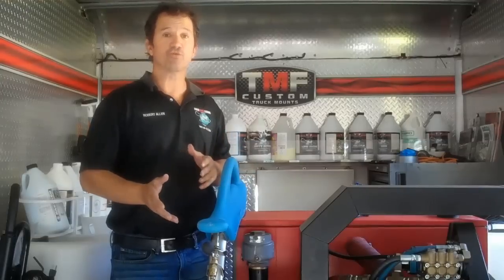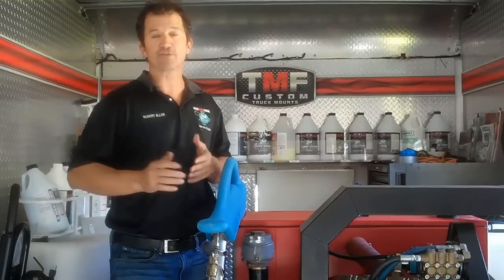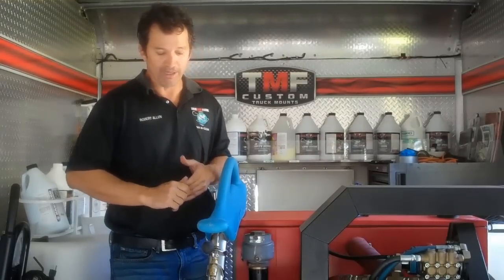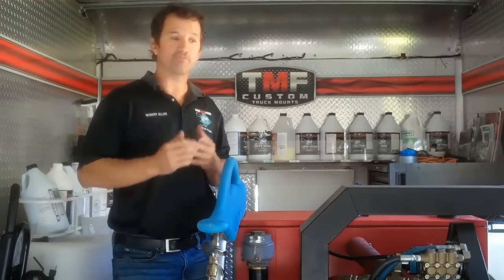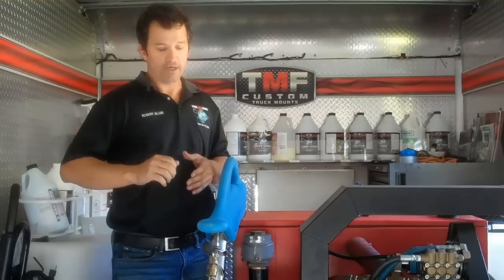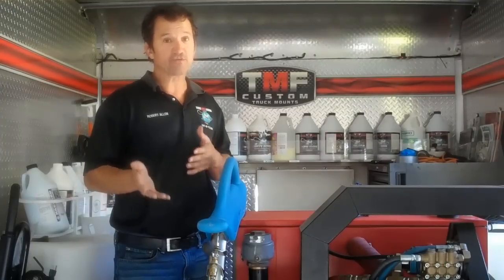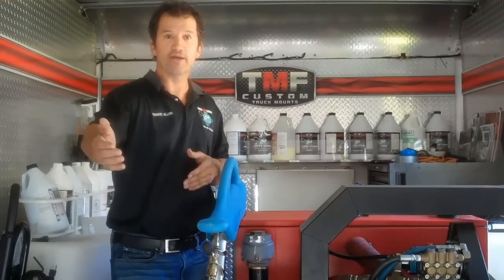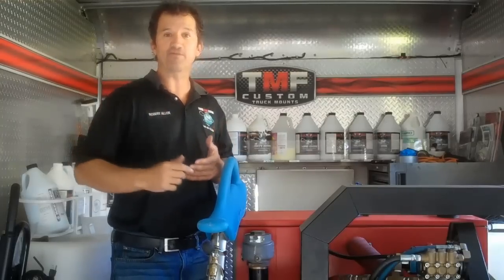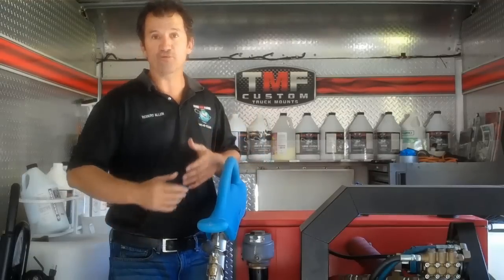I would probably just use this on low or medium soil carpets. I wouldn't use it on heavily soiled carpets — what we call 'rat nasties' on the forum. For those I'd bring out my spray-and-vacuum wand, like my titanium or my Westpac standard s-bend wand, which cleans a little deeper even if it takes longer. One thing about this unit — it does clean a lot faster because you can clean on both the forward and reverse stroke. Also, if you're someone who doesn't pre-vacuum first, this is not the wand for you because it won't pick up small or larger debris inside the carpet.